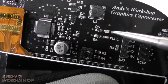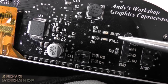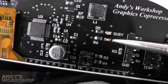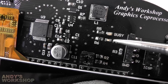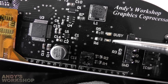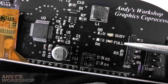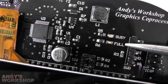Here we have two LEDs: busy and full. The busy LED indicates that commands are coming in from the Arduino — it just indicates activity. The full LED indicates a problem: there is more data coming in from the Arduino than the STM32 can handle. I've implemented a circular buffer inside the STM32 to buffer commands as they come in, and the STM32 empties them as soon as it can. But if the buffer should fill, the full light will light up. This doesn't mean commands are lost — when the buffer is full, the STM32 will suspend the I2C bus so that further commands are held up waiting for the buffer to drain.